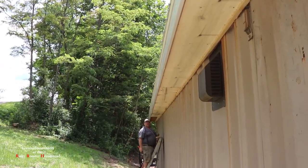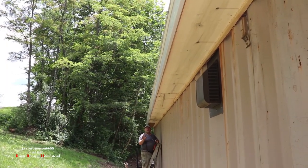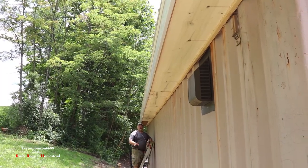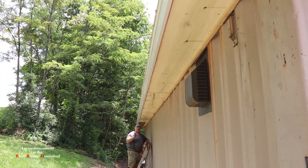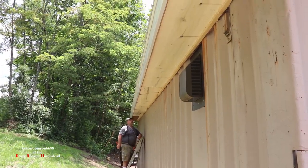This is what we cut all the wood for. We're going to put it under the eaves and then we're going to drill all of our holes. But we're going to wait for this wood to dry up a little bit — we know it's going to shrink. We're going to let it dry up a little bit and then go ahead and drill it. Julie can primer it and paint it. I think it'll look fine.